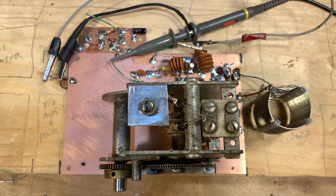I was really amazed when I fired this thing up. I'm very much used to having a new VFO take a long time to settle down because I've had the soldering iron in there and it's jumping around as it cools off. You put it on a frequency counter and it's all very disheartening. But with this thing, even though it was still hot from recently soldering these big capacitors in, as soon as I put it on the HP 8640B counter and signal generator — man, it was really stable down to the lowest digit, which is tens of Hertz. It doesn't jump around.